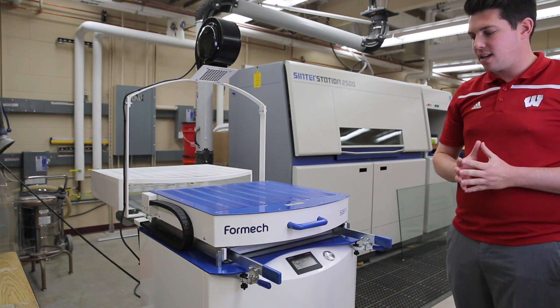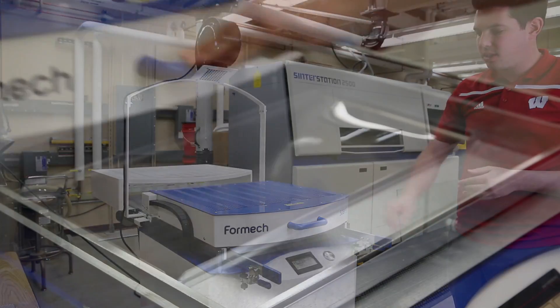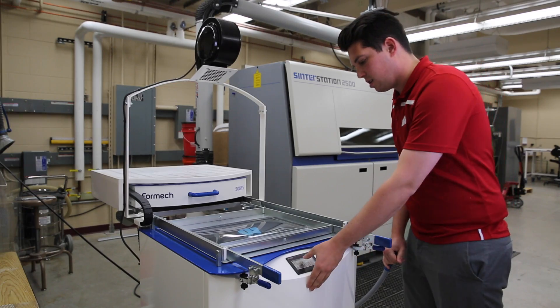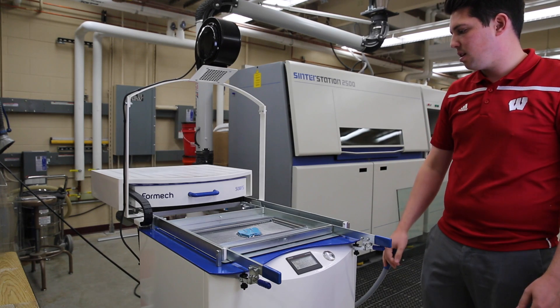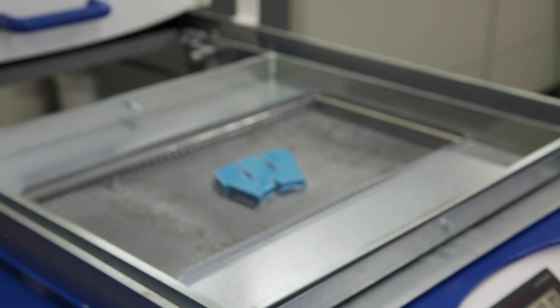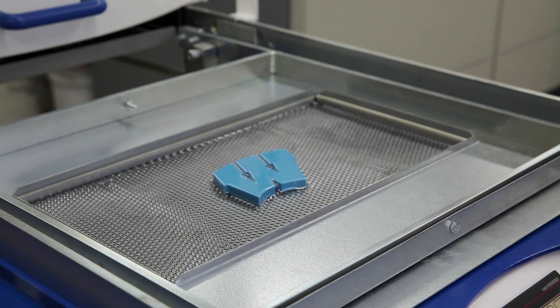For this material, it requires about 18 to 19 seconds to bring the material up to temperature. Therefore, I'll bring up the mold, apply the vacuum, and you can see the plastic was sucked down by the vacuum around the mold and we'll have our Wisconsin W.